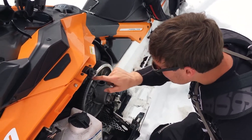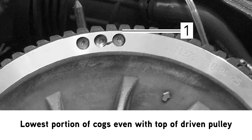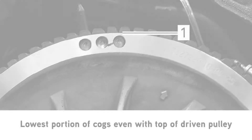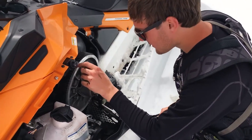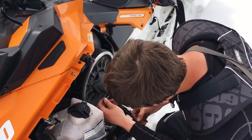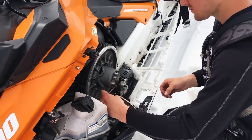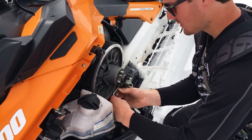I like to look at the ribs — the U-marks right here. If they're just above the top of the sheave but you can still move the belt, then I'm pretty happy with that. You can see it's a little bit taller but still free. Then just knock the nut and bolt back up, and that's it.